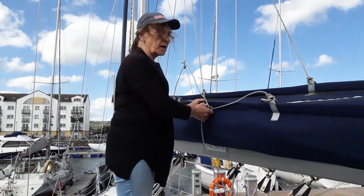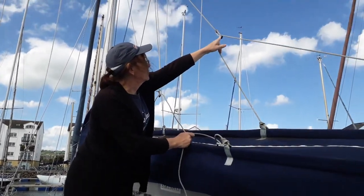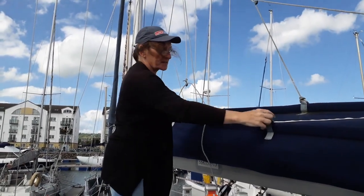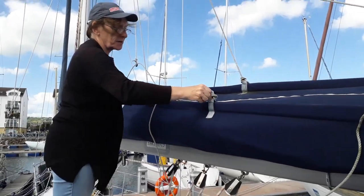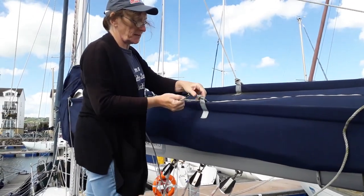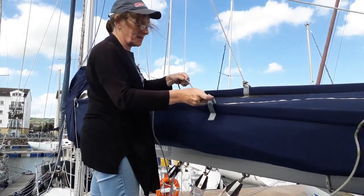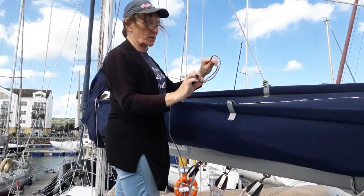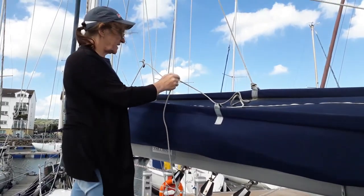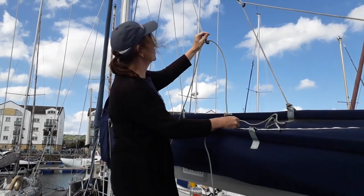What are you doing Bev? I'm taking the pulleys off, the little pulleys, and I'm just measuring up for my Dyneema that's going to replace it. This old halyard knot will have to come out, but the problem is that this stuff shouldn't come out as easily as this. You shouldn't be able to undo a halyard knot by hand, but you can, because these have worked loose while we've been under sail. So I'm not really that impressed with them. But the idea is that we're going to get rid of these little pulleys and get rid of these sharp ends.